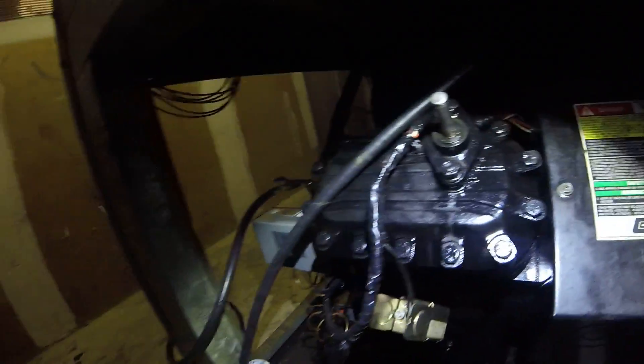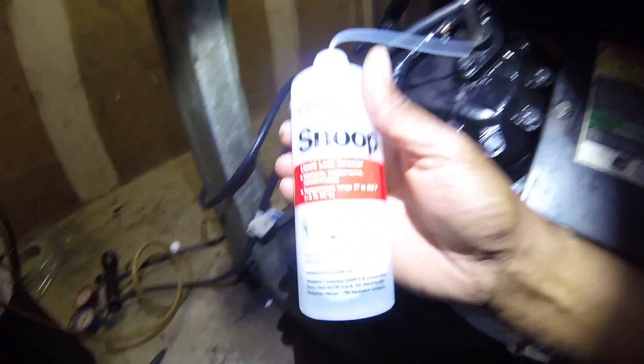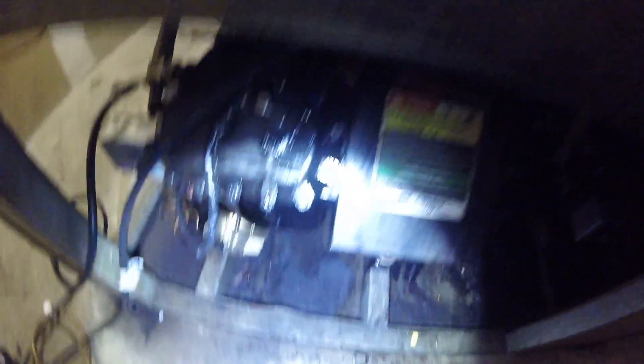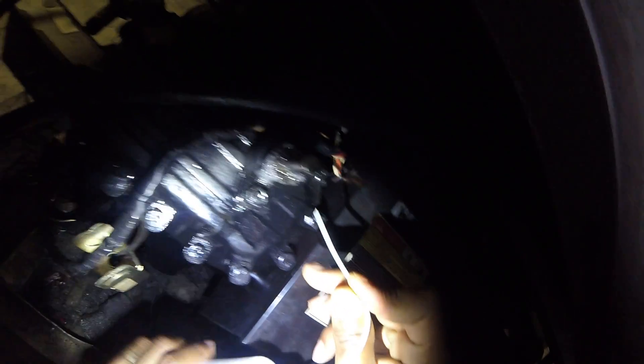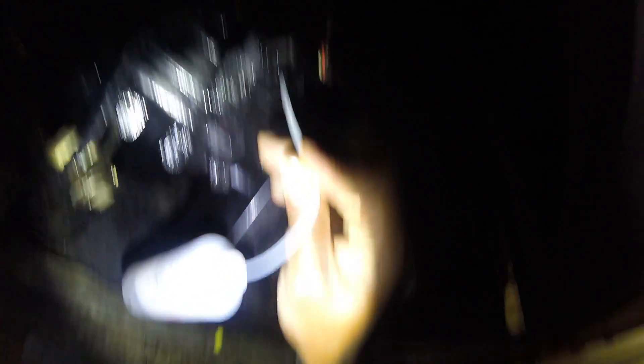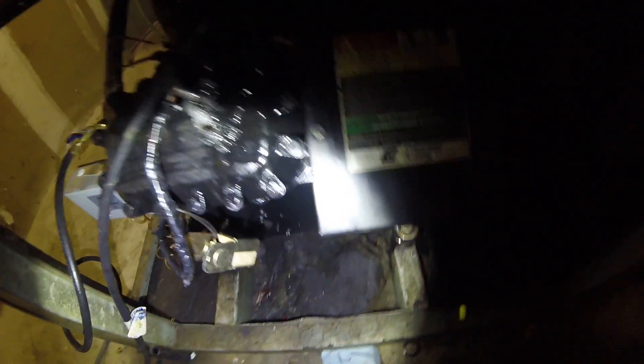See there's a little residue up here, and you see the leak detector — it's going off real bad around here. So then I get my snoop, put this on my head. You see that? Leaking real bad around this overload. So I found my leak.